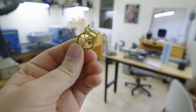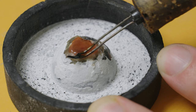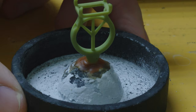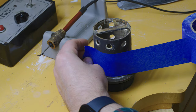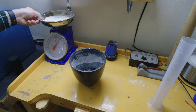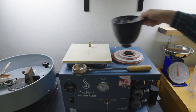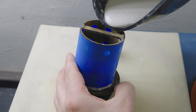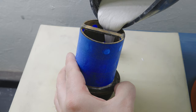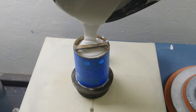Take a trip with me to the yellow bench — this is the land of spruing. If you are unfamiliar with what is going on, this is the beginning stage of a process called Lost Wax Casting. In short, this is the magic that turns this resin ring into a real gold one. Once the ring model is attached to the sprue base, I'll cover and enclose the model with this perforated flask. Now it's time to make our mold. I do this by mixing a predetermined measurement of water and investment powder. The mix is then placed on the investment table and covered with a plastic dome. A vacuum is activated which pulls air bubbles out of the mix. After a couple of minutes, I'll pour the investment down into the ring flask, then repeat that same air bubble removal process. I'll top off the flask, then leave it alone for a few hours to cure.